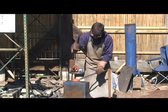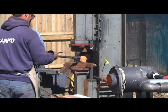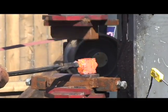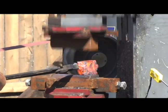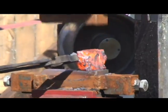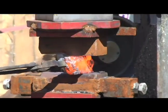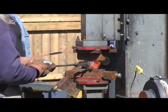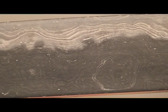At this point, the steel must undergo a significant amount of processing before it can be used to make a blade. The pieces of the bloom are heated in a forge to temperatures so high that they weld together into a rough mass — crudely shaped, brittle, and full of impurities. These roughly welded pieces are then refined. The bar of steel is drawn out, cut, folded over, and forge-welded again. This process of drawing, folding, and welding is repeated until most of the impurities are driven out and a relatively even distribution of carbon is achieved throughout the steel. Ultimately, as many as a million layers of steel may be formed.